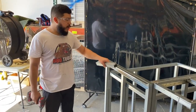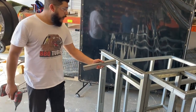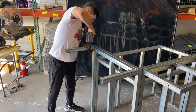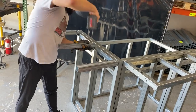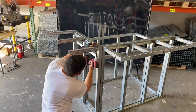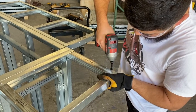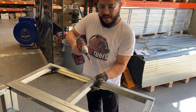Now with that, we have the catcher track screwed in. We're going to slip in our 14-inch overhang tubes — one on each end and one in the middle — they just slip right in. We'll get the ones on the sides first and then the one in the middle. Now we'll go ahead and get the screws on the bottom. Then slip in the catcher track into the tubes and go ahead and screw in. When screwing in on the top, make sure you're holding this up tight because if you don't it'll snap down.